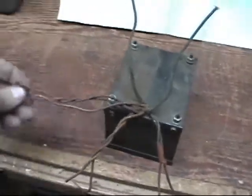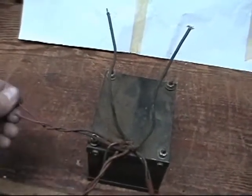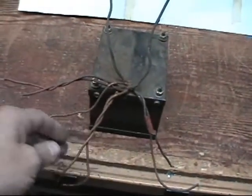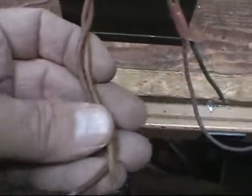What you'd want to do if you were going to use a transformer like this is hook it to a dim bulb tester. Put a couple of clip leads on it, go to a dim bulb tester, plug it in, and apply power to it. Then put a voltmeter on each one of these windings — start at the high range on your voltmeter. Make sure it's on volts and not ohms, or kapow goes your meter. Your high voltage windings are probably these reddish-brown ones under the lights. This would probably be your five or six volt secondary and this would probably be the tap — but not necessarily. This could be the center tap. That's the way I would check it.